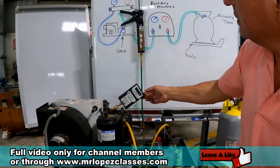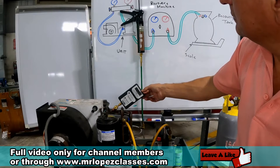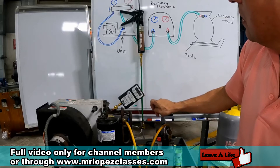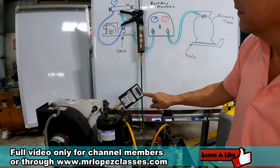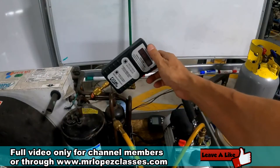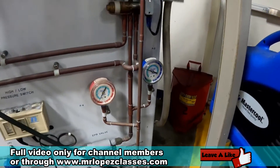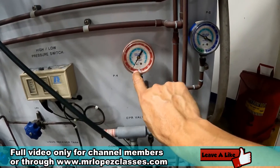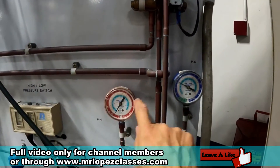At this moment it's 3,000 microns — 2,900, 2,800, 2,600, 1,700 microns. In this particular example, we have a low level of refrigerant. On the high pressure side we only have 3 PSI, and exactly the same 3 PSI on the low pressure side — in both sides we have very low pressure.